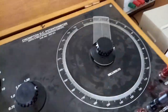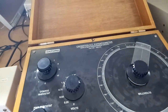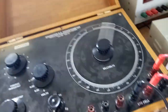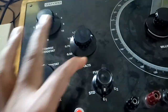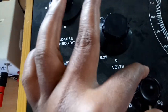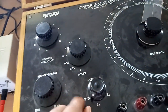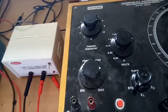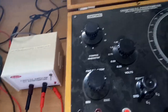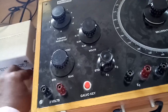For the Crompton's potentiometer, we first have to do standardization. Standardization is done with the standard cell. After connecting the standard cell, we change the function knob to STD (standard). After moving the terminal to STD and connecting the standard cell, the galvanometer is connected. A supply voltage of 2 volts is required for the Crompton's potentiometer.